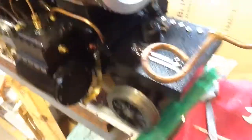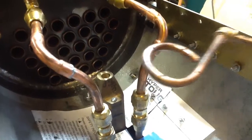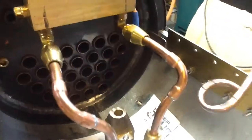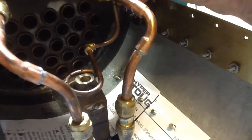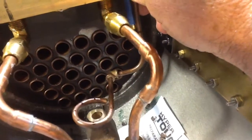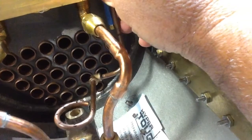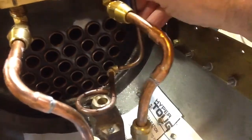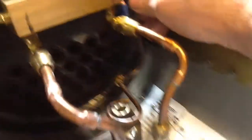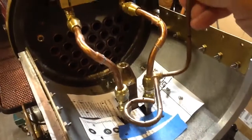Once I got that done, I started looking at the actual blower ring, where it sits, and figuring out the piping. I've made some fittings. I thought this thing would be a lot better — let me see if I can wiggle it in there. It would be a lot better if there's a fixed elbow that holds it in place, and then I have the part that bolts on the fitting over here where my hand is. Otherwise you'd be getting a wrench back there where that 90-degree elbow is — it's awfully close to the blower pipes. If I put the fitting over here to the side where my fingers are, it would be a little easier to get to and a little more out of the way. So that's why I made this fitting up.